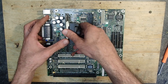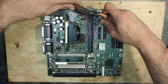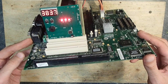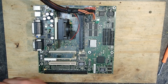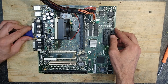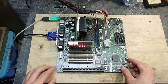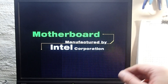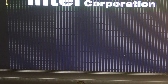Let's see if the board is alive at all. With some memory and a Celeron 433 for testing, the setup should be ready. The PSU turned on as soon as I connected the cable, and we have some POST codes — meaning the board is at least partially alive. I connected the monitor and keyboard to see if we get any video signal. There is something, but as expected the graphics chip is damaged and there are vertical stripes on the display.